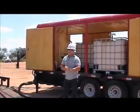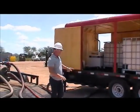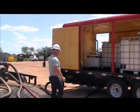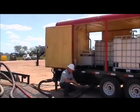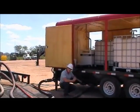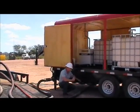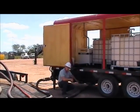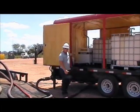Today we're going to talk about our generation 4 unit. We've actually taken the hydration coils and moved them to the undercarriage of the trailer itself. Notice that we have the inlet on this side and the outlet on the opposite side. We pull the water in through the hydration unit — we can either draft through it, sub through it, or we can pump through the hydration unit. The coils are positioned so that the water moves through. Static mixers mix the fluid. The chemical is injected at the front side.